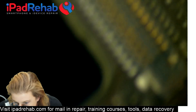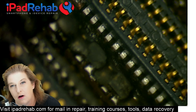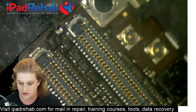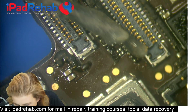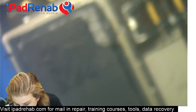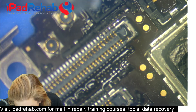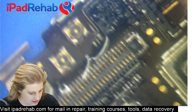As we look closely at those joints, they're slightly starved for solder. Although this connector would work, I would be concerned that connect/disconnect cycles would rip the connector off the board. So I need to beef up those connections by hand — I'm going to put some flux, get out of my board holder and back onto soldering on the mat so that I can turn this board to get at an angle. I'm going to add some flux and then use the mini hot tweezers.